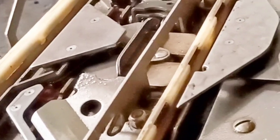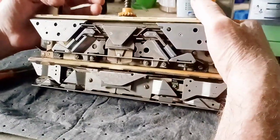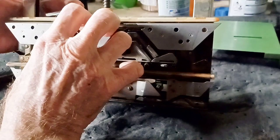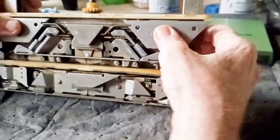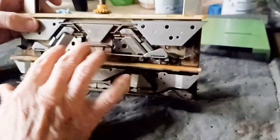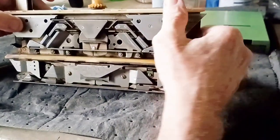So this is what we're saying: all of this is calibrated so that when these slides are activated on the top with that GX lever, all of these springs let this stuff go, but when you're out of that particular setting, they're all spring-loaded into their positions. You see, I can't even push those down. There's no spring load involved in this particular setting. These are mechanical movements that only move one time, and that's in the GX position.